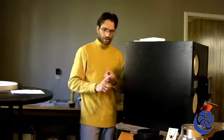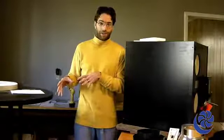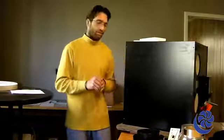With regard to the rest of the clearances, it is recommended that you have those clearances for other service-related issues, but if you do not, it's not going to be a hazard. If you're putting the unit in a location where you are going to have to take the unit down or uninstall it to actually do anything to it, then it doesn't matter. You could mount this thing within an inch of the wall. I said the clearance recommendations are only recommendations. There's no hazard associated with them.